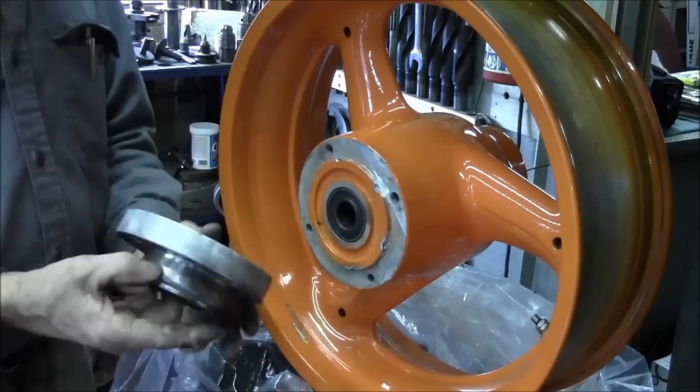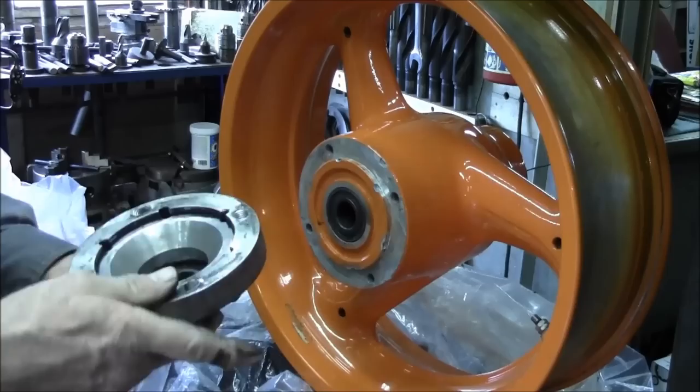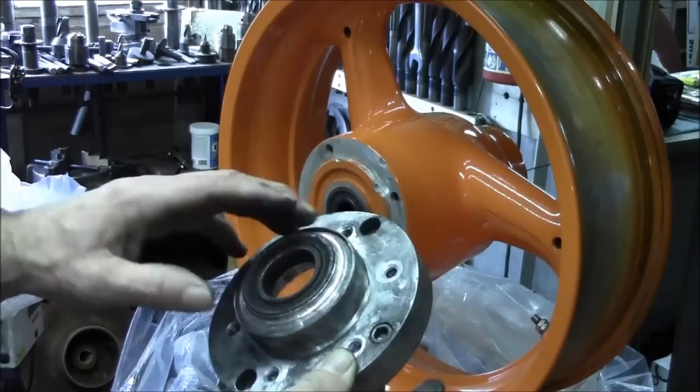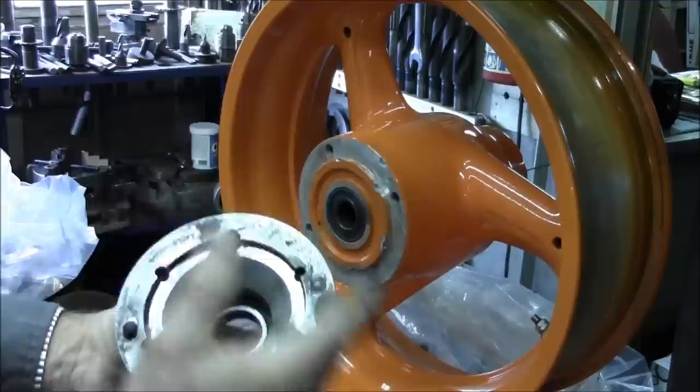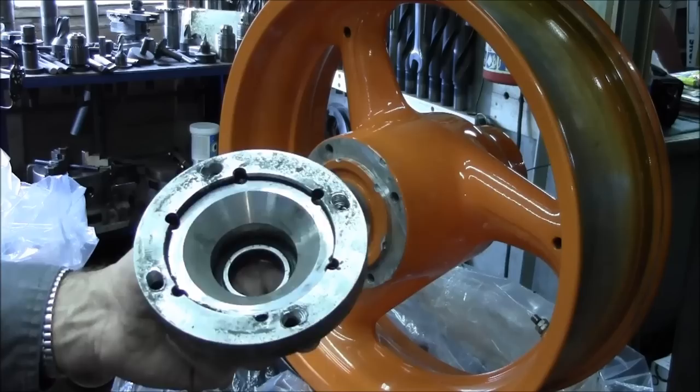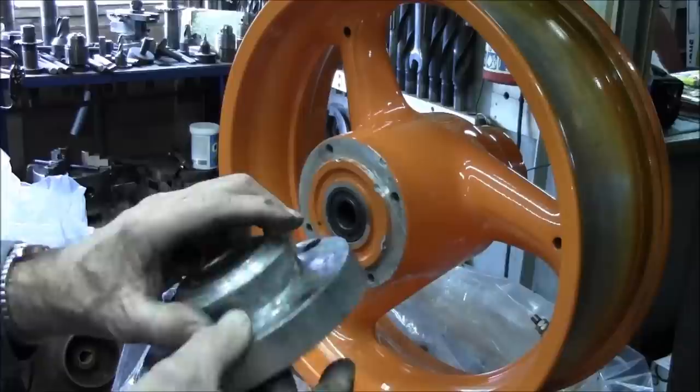Now, of course, this was mounted on the other rim that we have those holes that had breaks in them, okay? And these four are held in with socket head bolts, and then the other six-hole pattern bolts into here that holds the sprocket on. And you can see that these actually got loose, and that's all galled aluminum right there. So, you know, that's why we're making a new piece here. That's what it's really telling you.